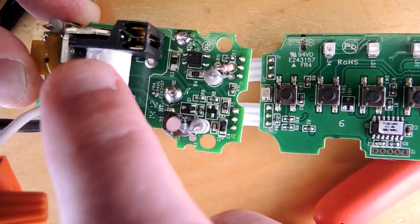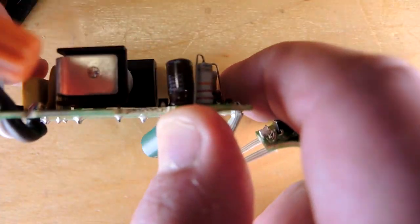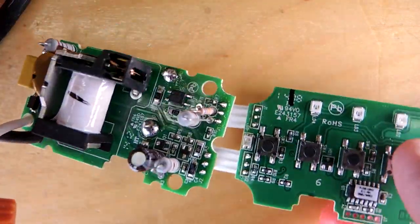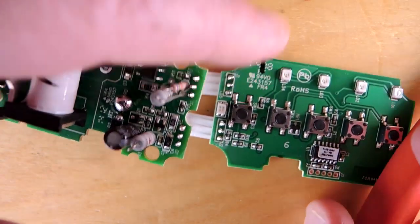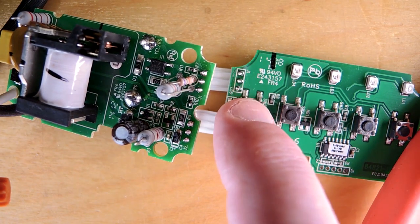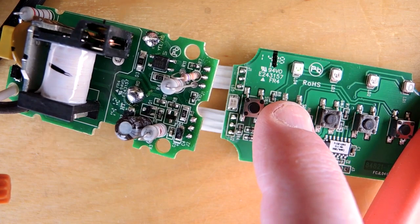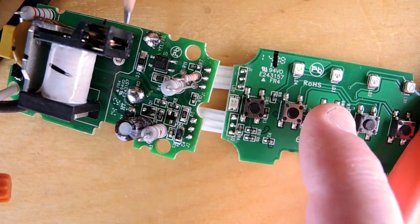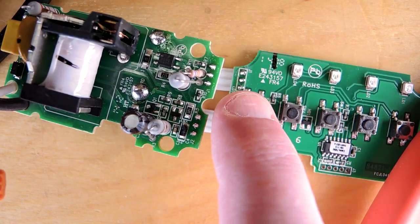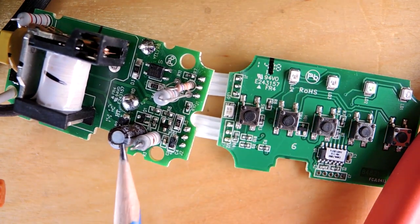The reason that's most likely is there's a capacitor here which looks like it forms a smoothing element for the voltage to the relay. To check that out, I tacked on a capacitor in parallel to increase the capacitance. Let's re-energize the circuit. Now the relay actually just seems to be working — pulling out when I turn the system off, pulling in when it turns on. This is the exact behavior the assembly had when it was new.